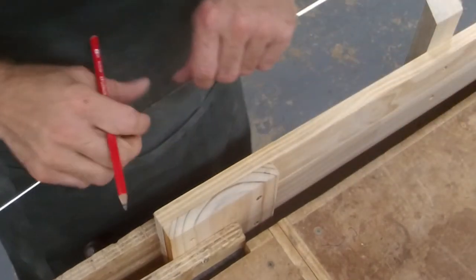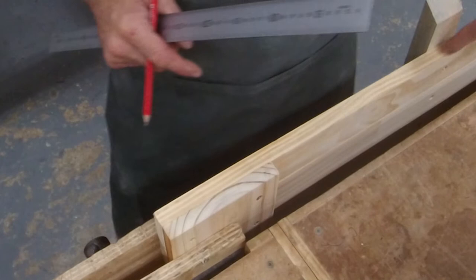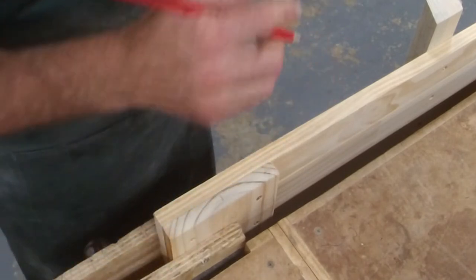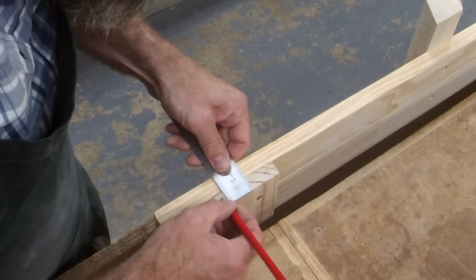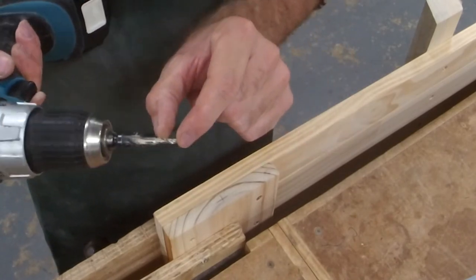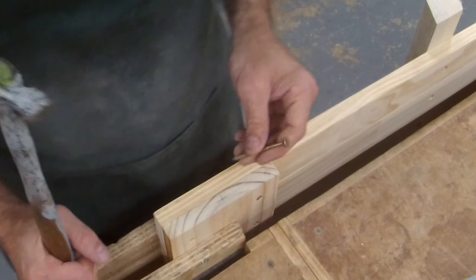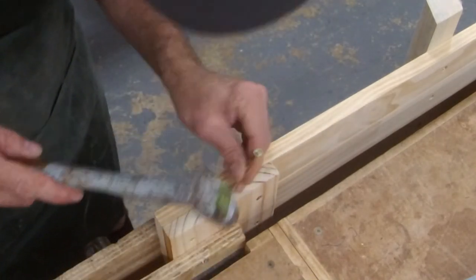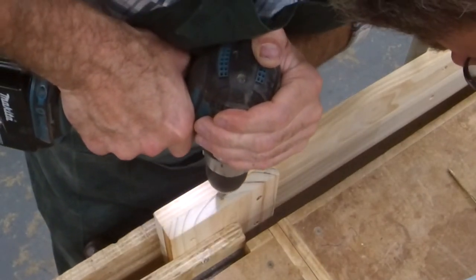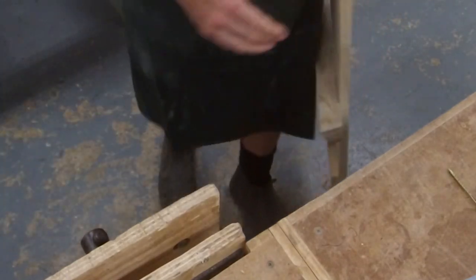All right, for this one, I need our pilot hole to be in the support, in the back, the bottom backrest support, not in the long backrest, it's in the short one. So yours should be 140, so halve it, 70, and I want it in the center. Be really fussy. It's fine just to use the countersunk bit, I just need the little pilot hole, so I only use the drill bit part you can see. Hot tip: just use a screw, give yourself a little center punch hole. That'll make it heaps more accurate. Nice and upright. Done, that's all we need. Do it on the other side too.